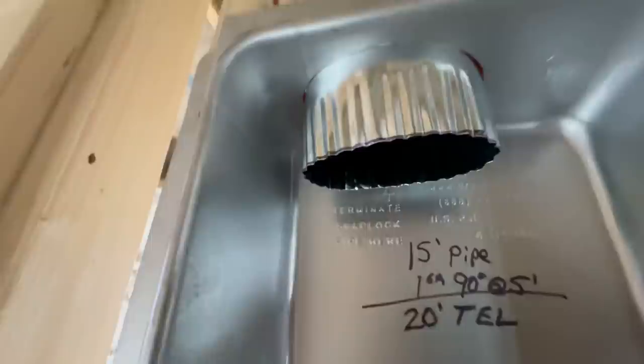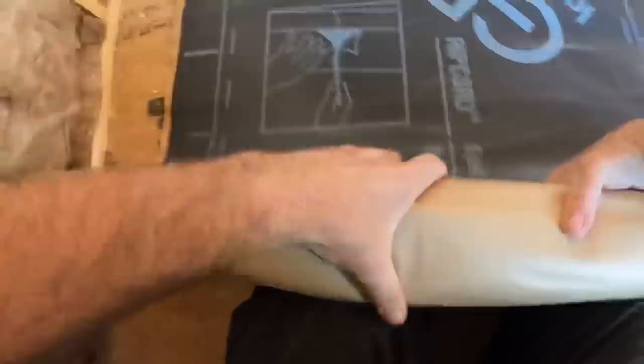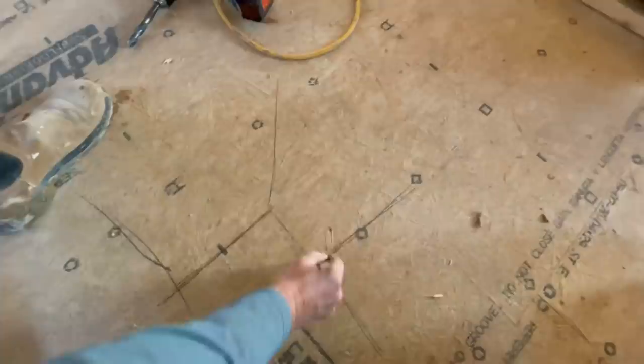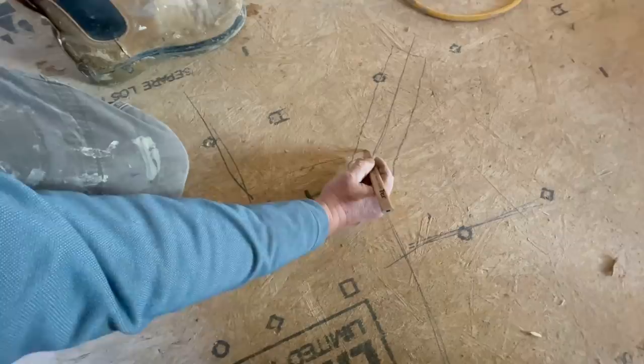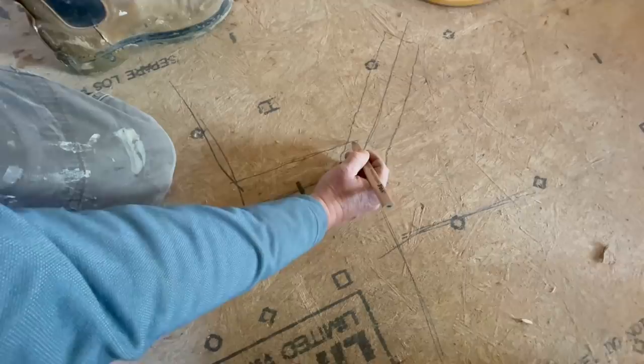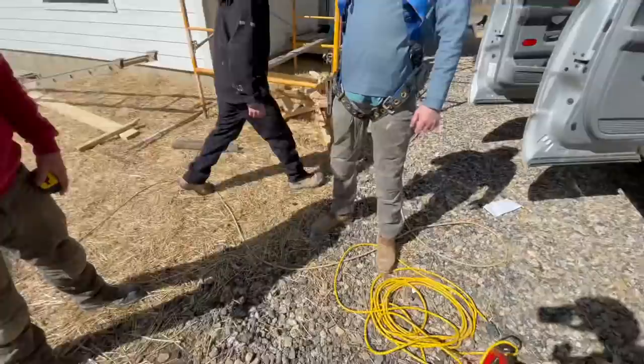This is actually a four-inch diameter pipe in a wall that's only three and a half inches, because this box is designed to ovalize the pipe and make it work in a regular wall. We're going to take 10-foot sections, roll it loosely as instructed so you don't have to handle a huge roll. For the valleys, we do the valley first, centered on the valley, then cut it there. The other pieces run across and lap six inches, cut short here, and the next piece laps that as well — sealing it all up.